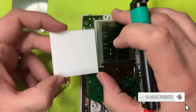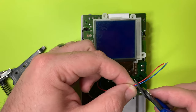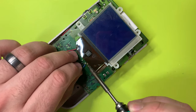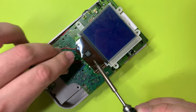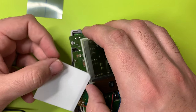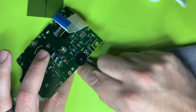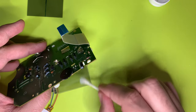Let's go ahead and give it a test, see if we did it right. Gently place the backlight and the polarizer inside of the screen assembly as shown. Trim those cables down so that we can solder them to the motherboard. Solder the positive and negative wires to the joints as shown. We don't have to solder a resistor because it's the Handheld Legends backlight, which is pretty nice. I didn't pull off the protectors of the backlight or polarizer at this part as I was trying to mock up everything to make sure that everything's functioning properly.